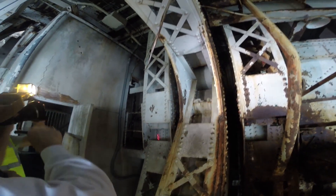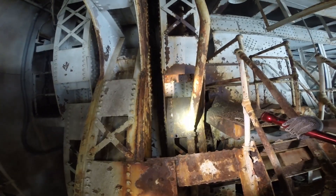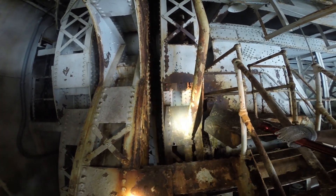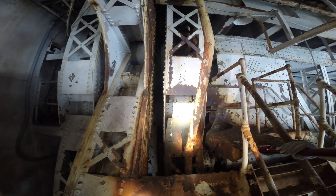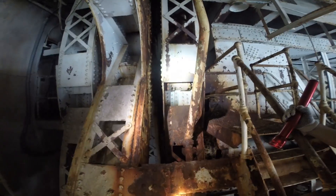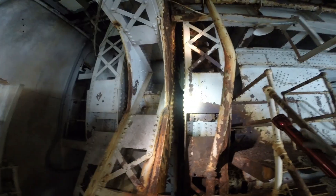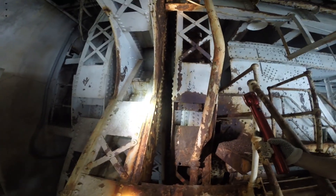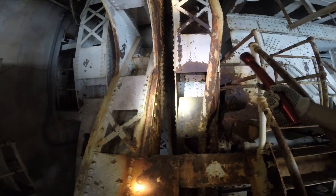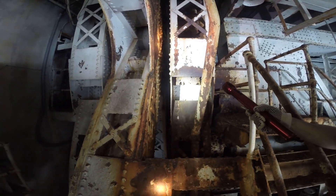That's what the column is supposed to look like. But now come over here and take a look at this column — it has quite a bit of holes in it, quite a bit of deterioration. They're so close together; how come one has so many holes and the other one doesn't? This is the curb line and the curb line is leaking. Basically when we salt, all the chlorides come in and it's deteriorating.